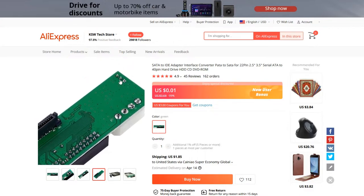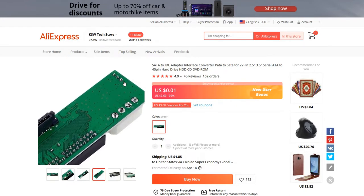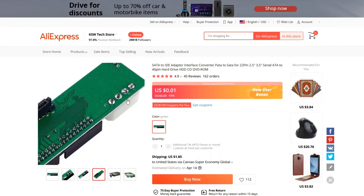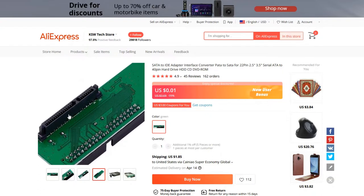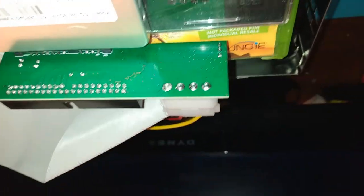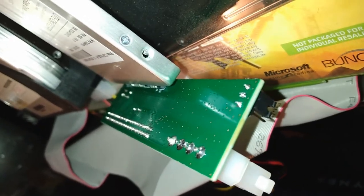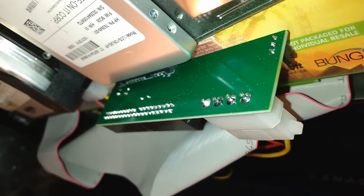Sometimes it'll look healthy on the surface, or at least kind of healthy. It'll look a lot like the rest of the solder on the board, for better or worse, but it won't really look like it's dangerous. And in testing these, I actually ended up having one that had a cold solder joint on a burnt pad. There just wasn't really a lot of conductive material left to it, but it looked on top like it was fine. So be careful for that.